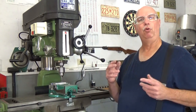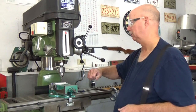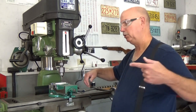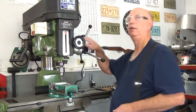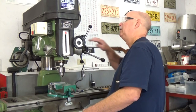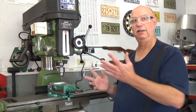The second hole to produce is hole number five, which is towards the bottom of the part. Hole number five's coordinate is X 309 thou, Y 951 thou. To get to the Y, I have no problem — I'm coming to this side of the part and I was already moving in the same direction from my zero reference. So I'm just continuing in that direction. Setting Y to 951 thousandths: counting off nine full turns gives 900, then 51 more — that is 951 thousandths. No backlash problem because I'm moving in the same direction I moved originally.